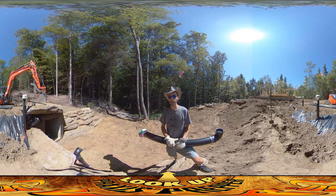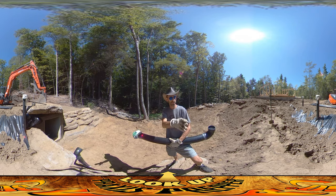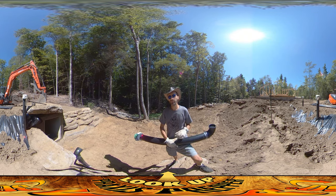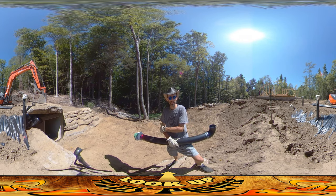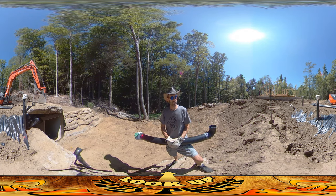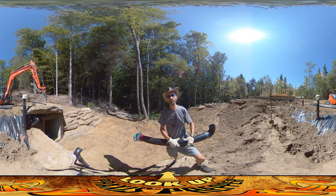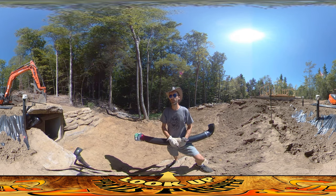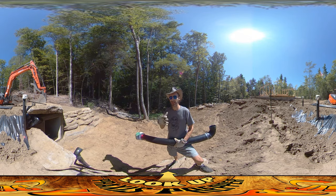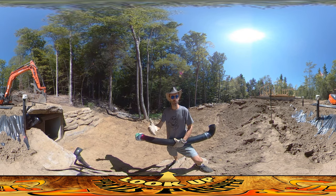As you can see behind you, we have some of these light tubes already stuck down into the ground. We're putting down some black plastic that's going to be a layer about one to two feet beneath the dirt surface. We're not putting the plastic everywhere, but around the edges to shed away as much water as possible from the structure. We have asphalt tar on there, and that's going to help, but there's always leaks.